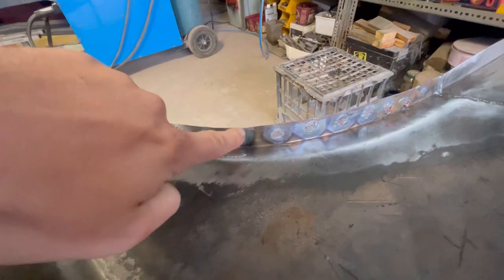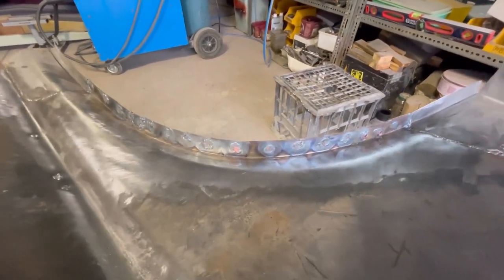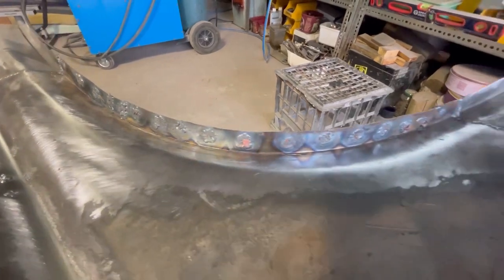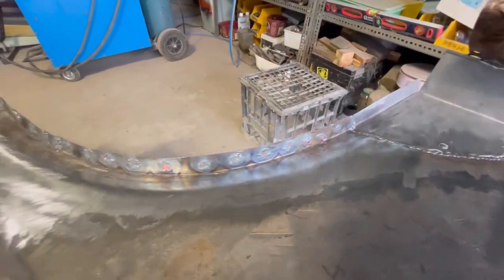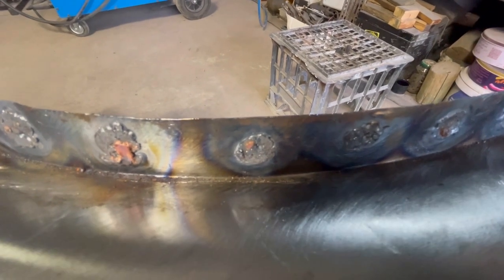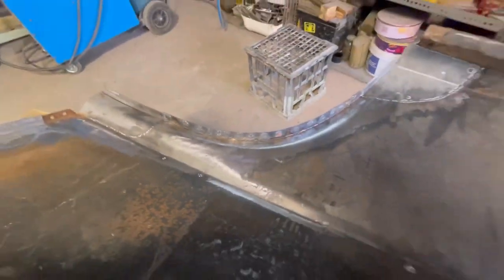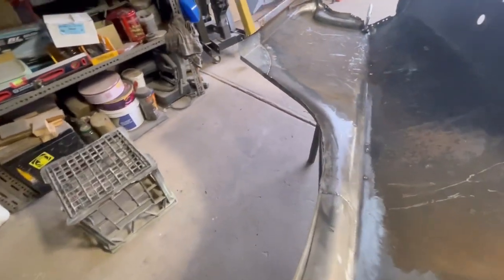I did have a little bit of the copper stick in a few spots, but I think that was just because it was getting so hot it was starting to bite into the weld. That's fine — just look at how much is actually penetrating through compared to these spots here where I didn't use any backing. Yeah, that's going to save me a little bit more time cleaning up inside there, which is always a good thing.